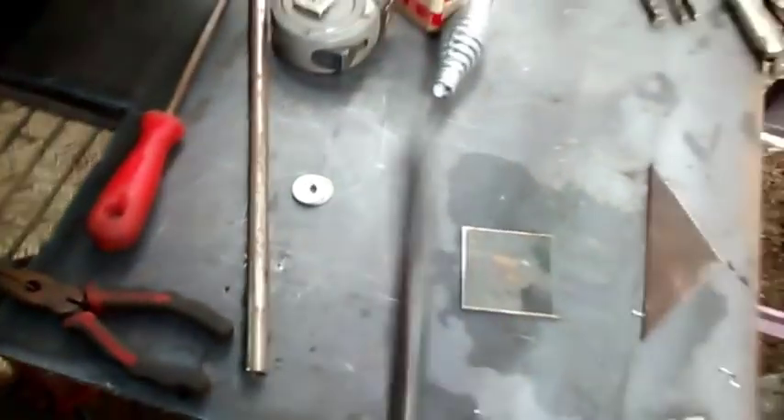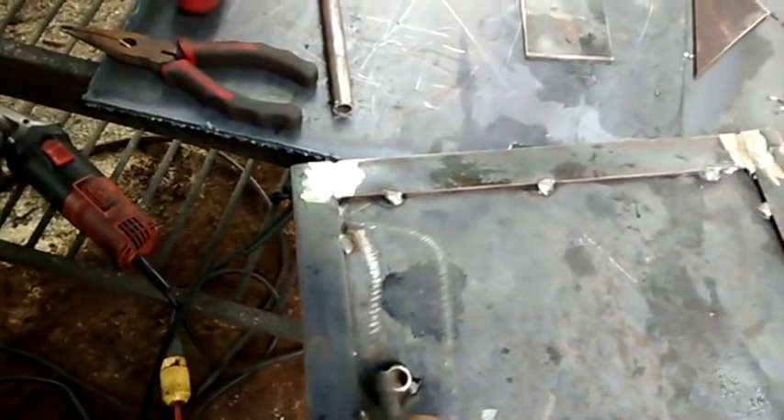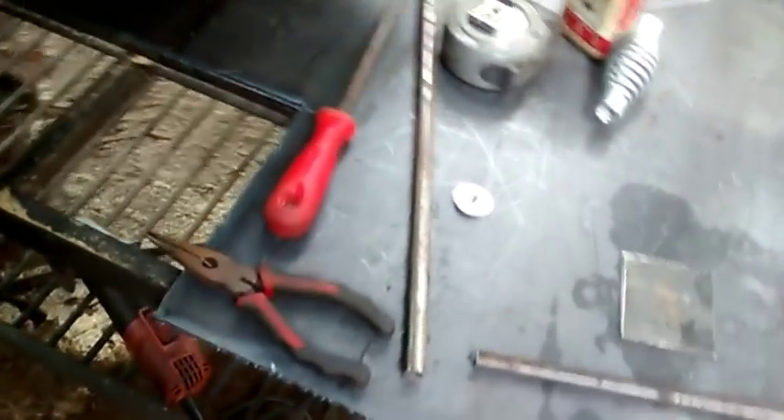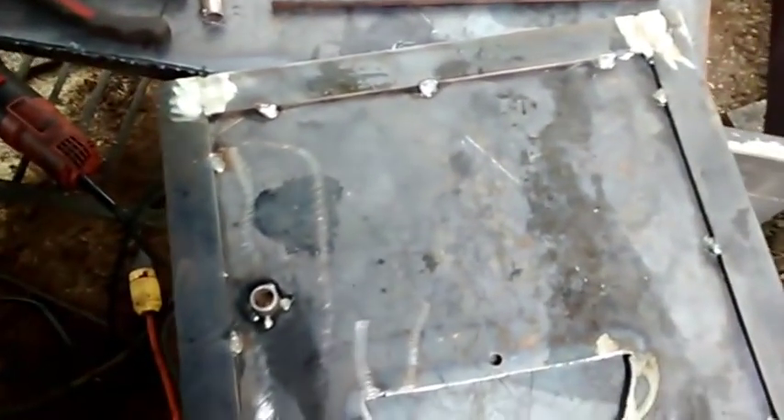And that's it. Then I usually set a couple pieces of eighth-inch down and set the door on top of it, that way it sticks through just a little bit on the back side. Now we've got to take this round stock and bend it. I usually come down two inches because that's roughly the measurement from the center of here to over where it's going to catch — two inches is usually enough. If you don't feel comfortable with that, go two and a half. You can always nip a little bit off if it's too long and it's bumping the side.